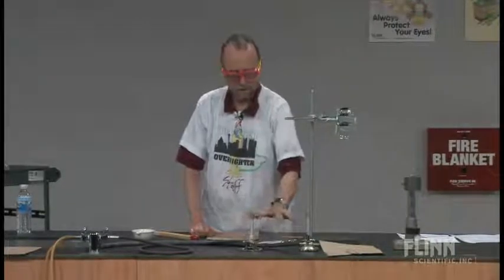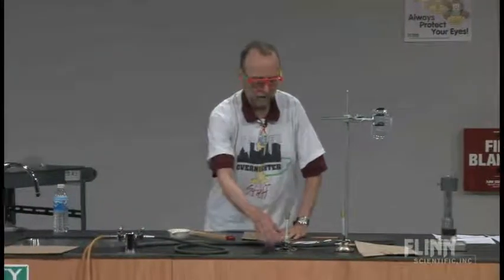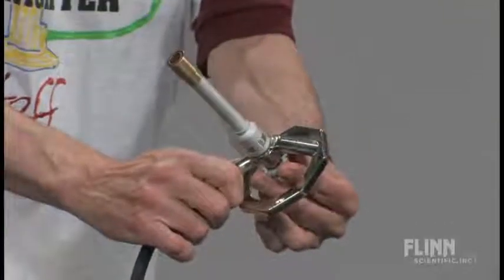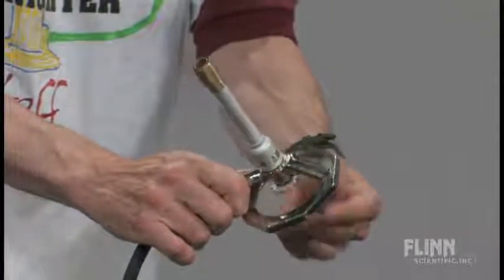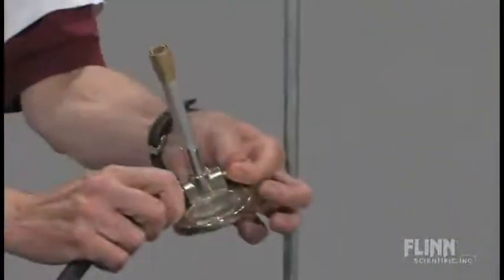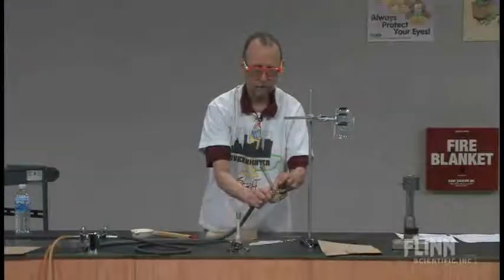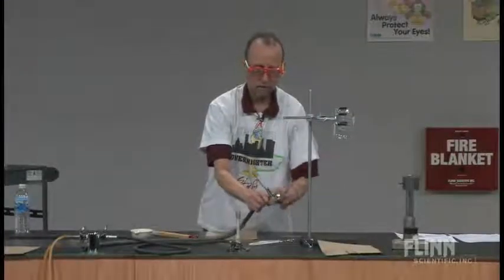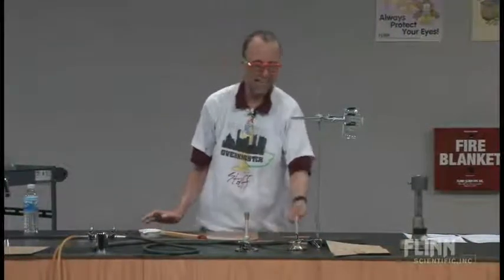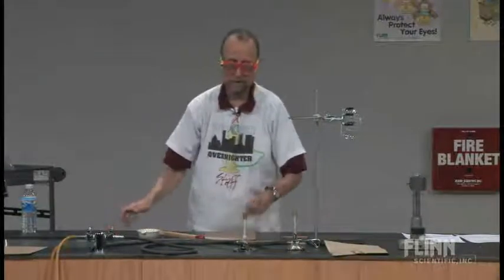These burners happen to be from methane. Flynn has this gas jet here — a nice gas jet — and they've given me two kinds of burners. This one has a gas opening here so you can let gas in and out, and the air control or airports are right here. Here's one with it on the side, and the airports are right here. When my building first opened they bought the cheapest burners they could get. They didn't have a gas control — you had to do it at the tube, which is not always the best method.